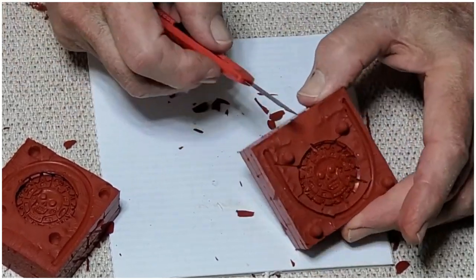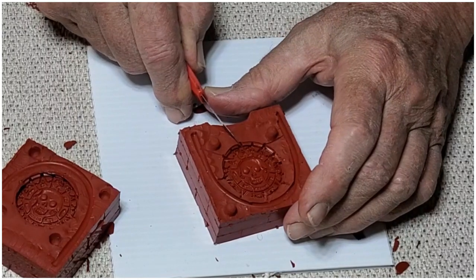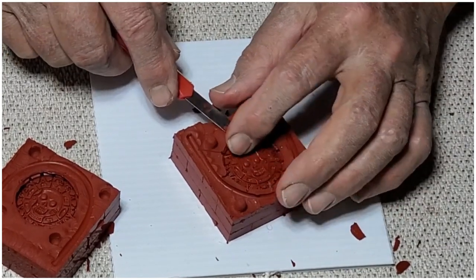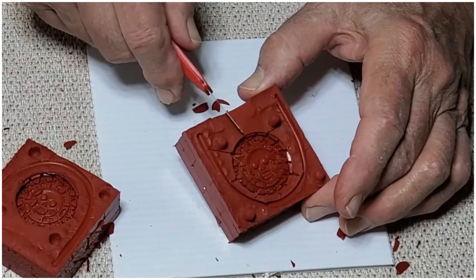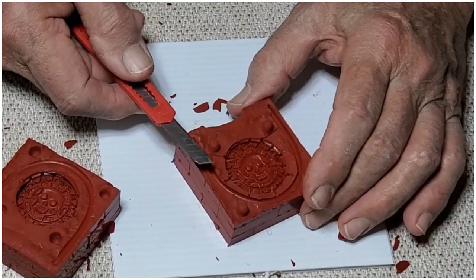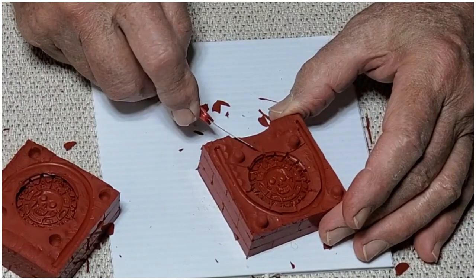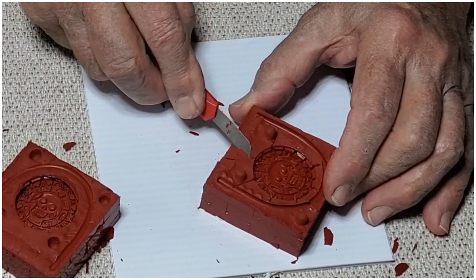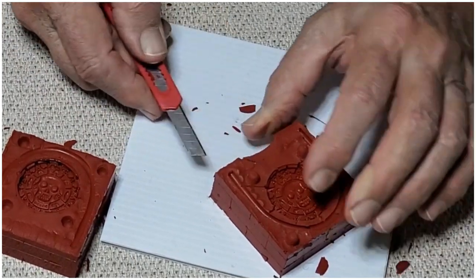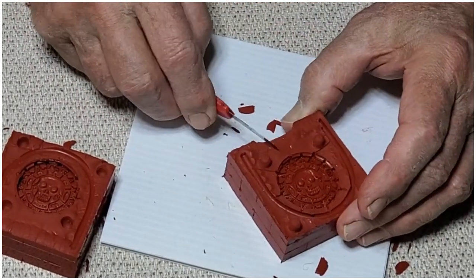Okay. So you can see this is where we want our zinc to pour in, this location right here. Make it a little bit bigger, but we're going to start off kind of small, because if this fills properly, that's easy to cut off. All these little points around here are real easy to cut off, and then it's a simple matter of just grinding the edge of the coin and buffing it, and we'll be done. If you make too much work for yourself, it just takes forever to do the cleanup. You'll eventually get it done, but you won't enjoy it as much.